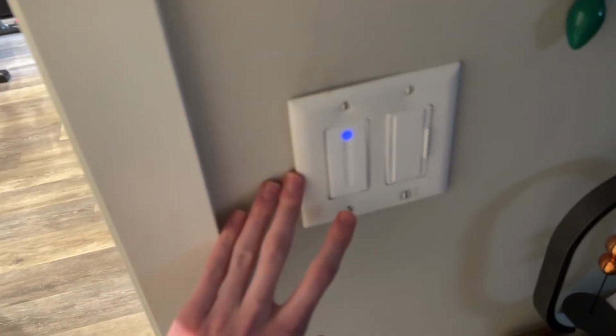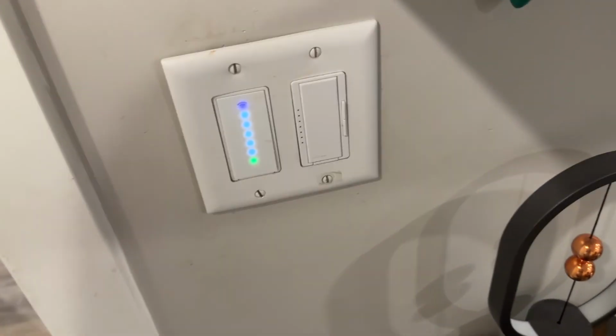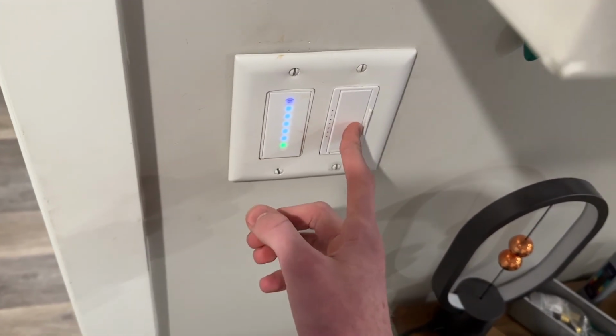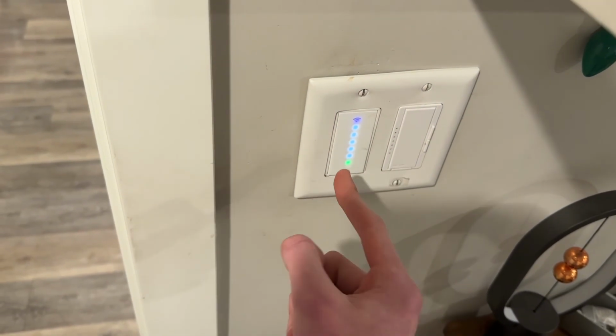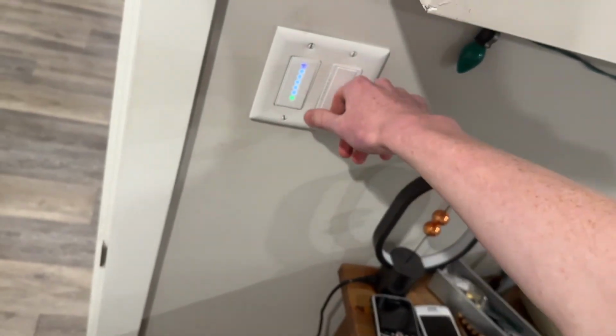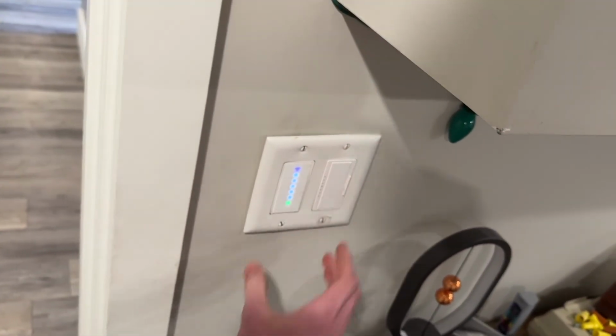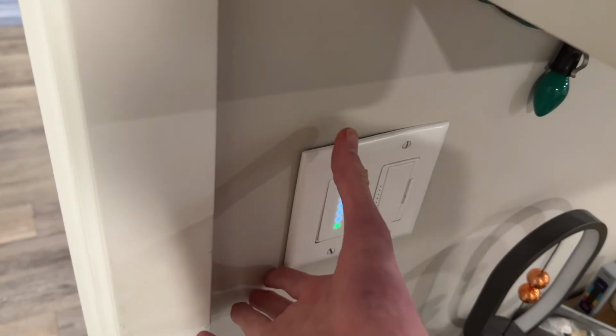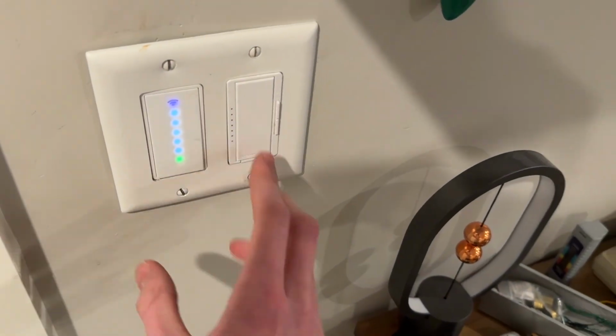In my bedroom down here, we have this first switch, which controls all 6 lights in the room here. And then this dimmer does nothing. It used to be 2 of these switches. Actually, the one that's in the bathroom upstairs is where it came from, because I installed this Wi-Fi dimmer here. There's a 2-gang box because the switch that used to be here, you'll remember from the original video, used to just control these 2 lights here, and then the one here, well, it's still here, it just isn't connected anymore. Used to control just the 4 over there. Now there's this Wi-Fi dimmer, which controls all of them, because I wanted all of them to be smart.